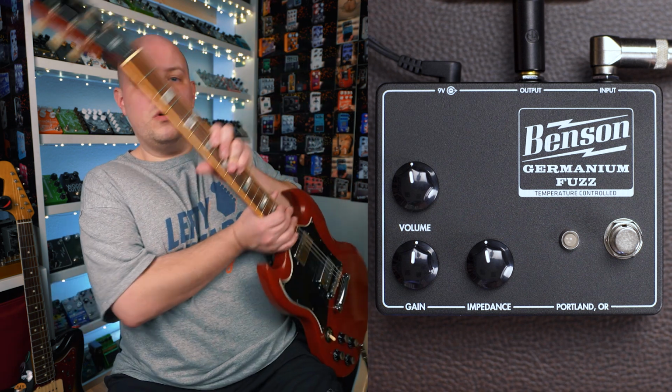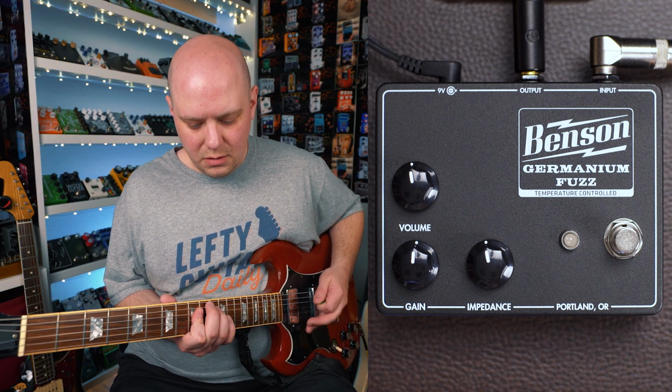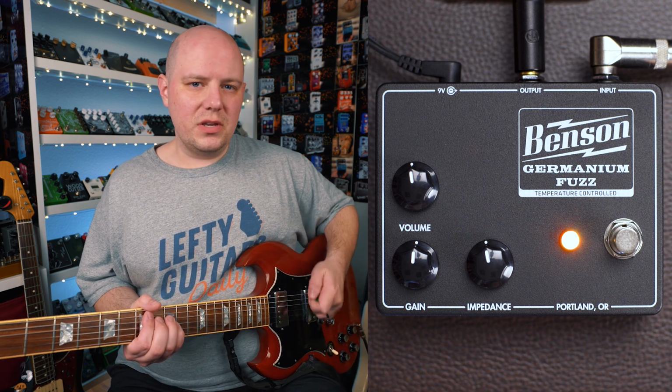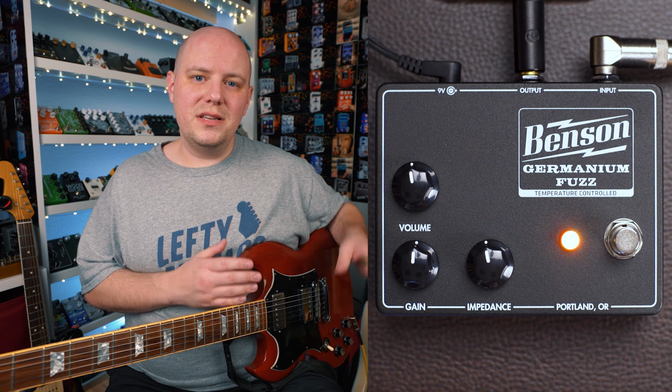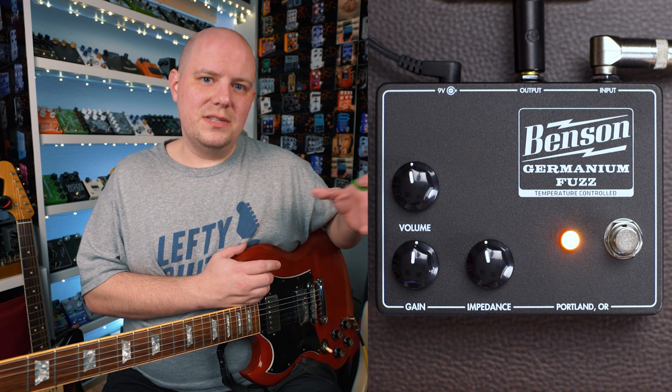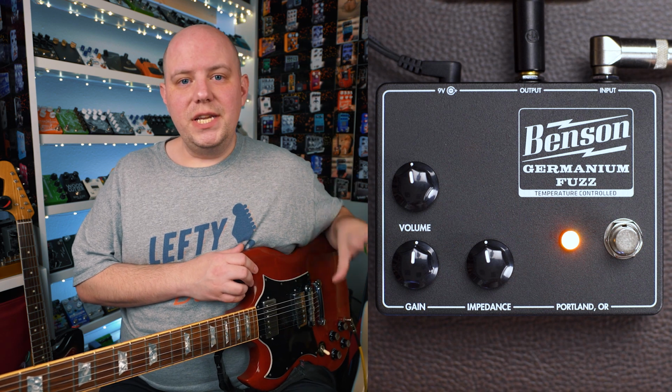And this brings me to one point that I really wanted to mention in this video, is that the pedal, the Germanium Fuzz, actually takes a few seconds or a few minutes to warm up. So it's kind of splatty, it doesn't really work on all of your playing, but that's just because it's warming up inside the pedal. It actually controls its own temperature to make sure that germanium transistor inside is sitting at the optimal temperature, which means it sounds its best, because in those old fuzz faces, germanium transistors can vary in sound wildly when they are too hot or too cold. So the technology inside the Benson Germanium Fuzz allows it to regulate the temperature of that transistor, so you always get a consistent sound after it's been warmed up.